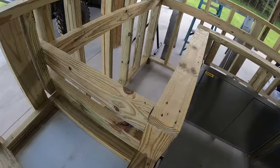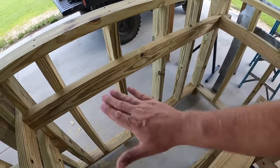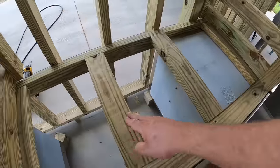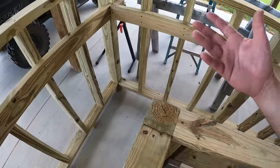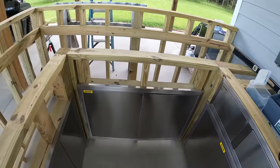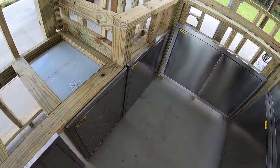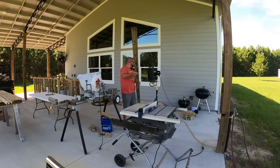I want to get some really good bracing for my plywood, and that's going to brace my cement board tile backer board very well, and ultimately the tile — it's just going to make my tile job that much better. The last area I need to focus on is too big of an opening. Even though I'm going to lay plywood across it, it would have too much give in the middle. So every so often I want to run some supports to really give support to that plywood. Then we can pull all the doors and drawers out — I already have them completely boxed in — and we can start sheathing all of this.